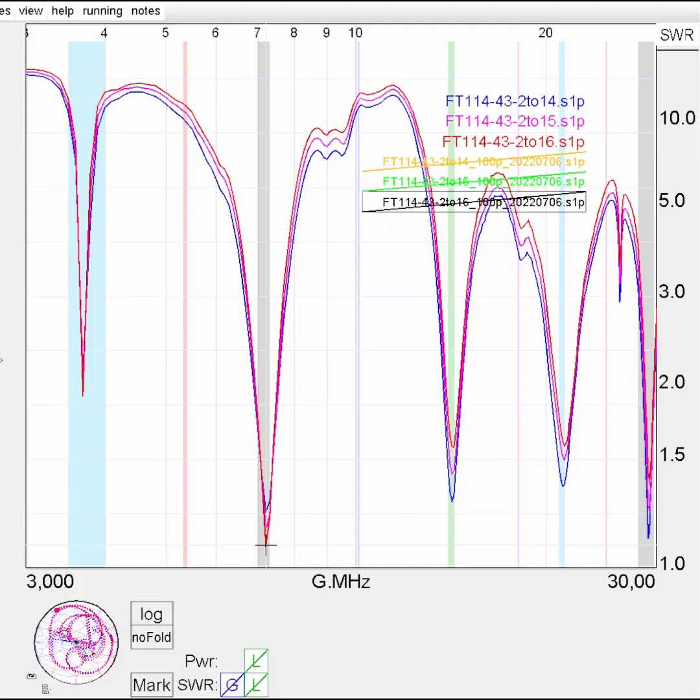The first three plots are a bit older — two or three years ago when I built the antenna and cut it in place. As you can see, it's very easy to hit your amateur radio bands when you're out with a Nano VNA, measure, and then decide exactly: one centimeter less, and bring my resonance point where I want it to be.